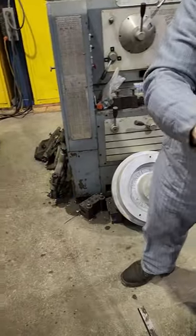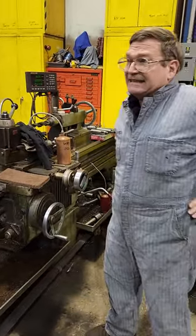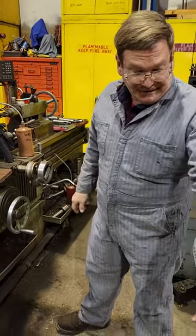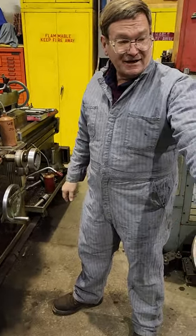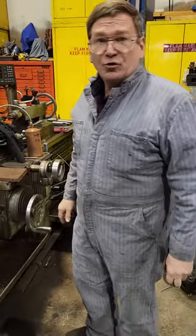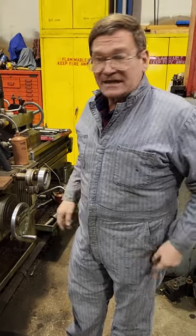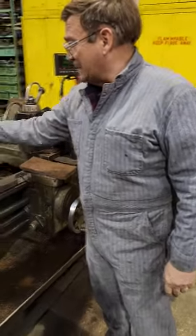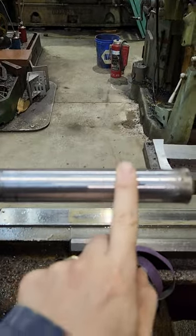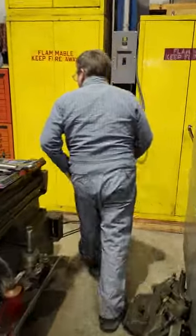Here is my really favorite for polishing — we can turn the spindle slow for this. This belt polisher I built back in 1987, but you can buy one pre-built. It takes a 108-inch belt. What you look for is under 'crankshaft polishers' — Goodson is the most common name that makes them, with a little electric motor. You can see how quickly it polished everything up in no time — did a nice job in a short amount of time.